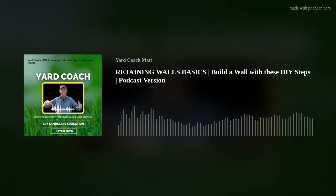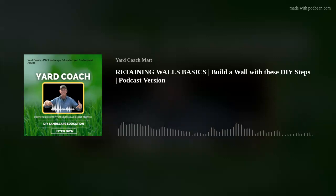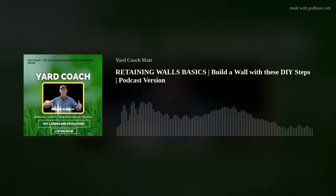If it's a troweled finish, if it's a broomed finish, if you're throwing color on it, whatever you want to do, decorative, whatever. I would also suggest on that face side that your vertical plywood form was treated with either diesel fuel or oil of some kind or a release agent from your concrete provider, so that form comes off really easy, separates really easy, and you can pull it and finish it very, very quickly.